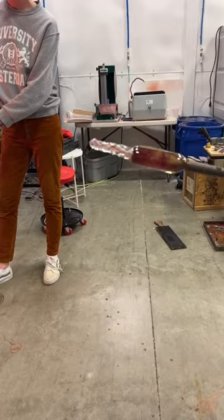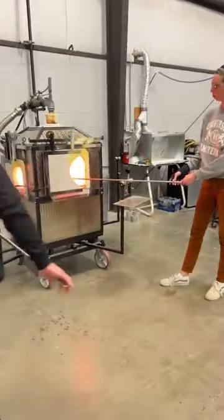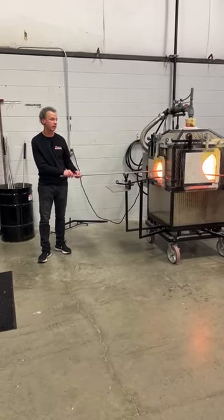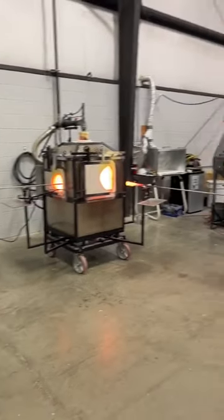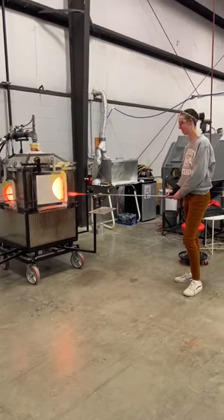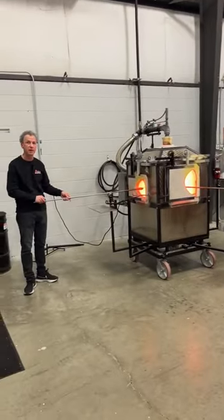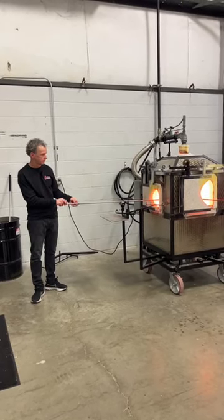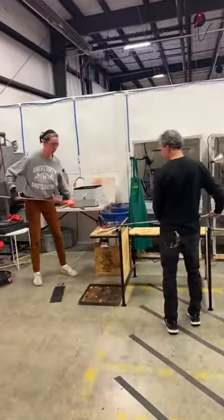You can start to see some swirls and color as the glass cools down. We don't want to let it get too cool or the glass will thermal shock. I'm going to flash it real quick — just reintroduce it into the reheat chamber so it doesn't cool off too much. I don't want it super hot and dripping, but I don't want it so cold that it cracks. This is running off of natural gas and air, pulling oxygen from the air.